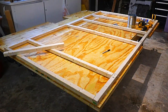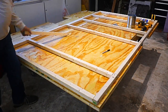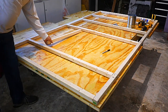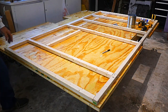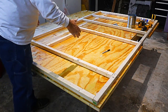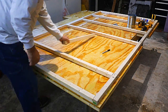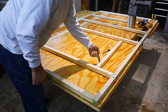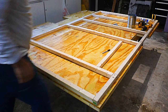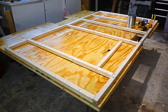Right in here where you see the really big space — that's for my door. I'm going to talk to my friend and see if he wants the door flush with the floor or if he wants it up a little bit or centered. Once I get his door measurements and where he wants it placed, I'll put my studs this way and then put some rounded pieces. Let's say this is the top of the door — I'll put a rounded piece in here, kind of square it and round it there, so the door has plenty of structure to be screwed to and the wall's good and solid.